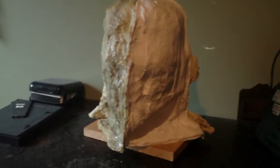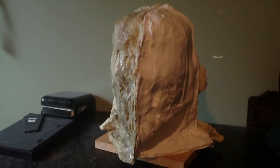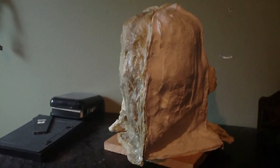This is the three-part hard shell mold that holds the silicone in place. It's a little sloppy for two reasons: one, it's really thin because rotocasting is a pain if it's heavy, and two, I ran out of plastic paste halfway through it, so I had to use plaster bandages for one-third of it.